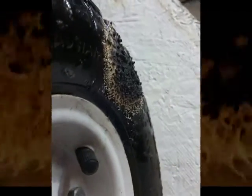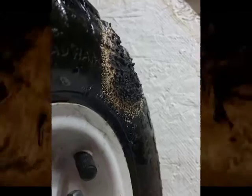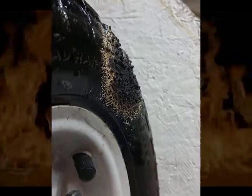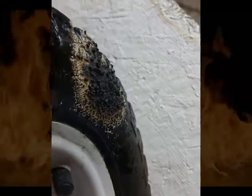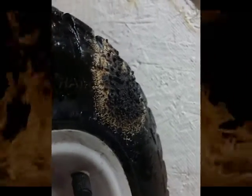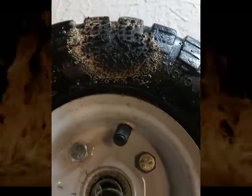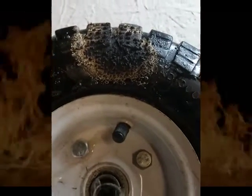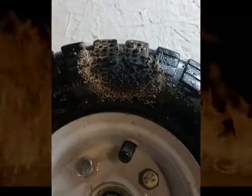You can see just how much it did char — notice how it kind of raised up like that. That charred material reacts with the heat and the flame, expands and swells to protect the substrate. Looks like that did a great job. This is Flame Guard clear coat intumescent fire retardant coating.